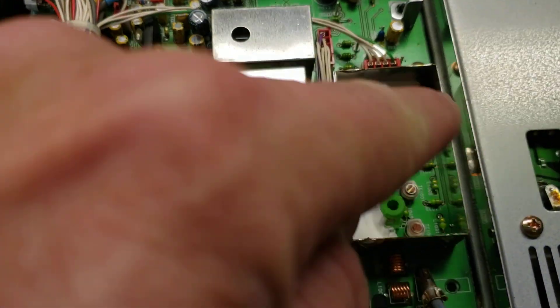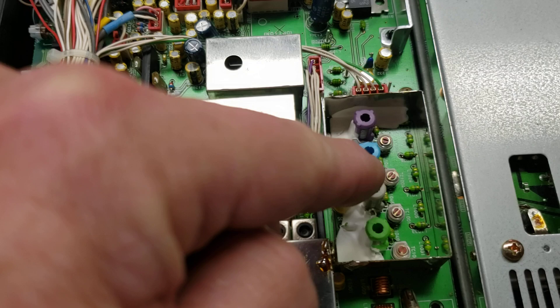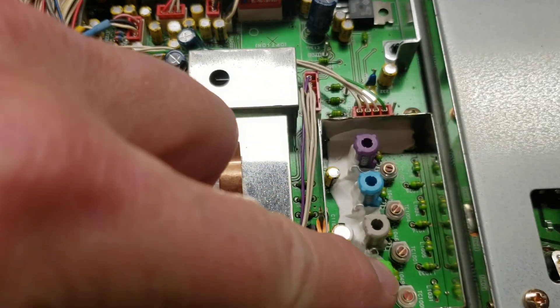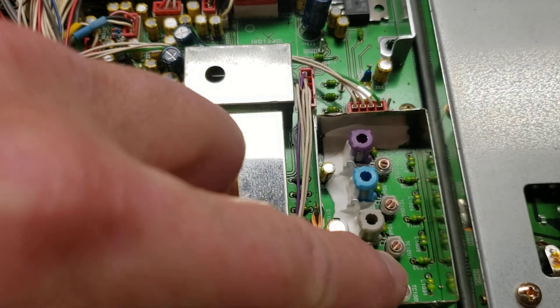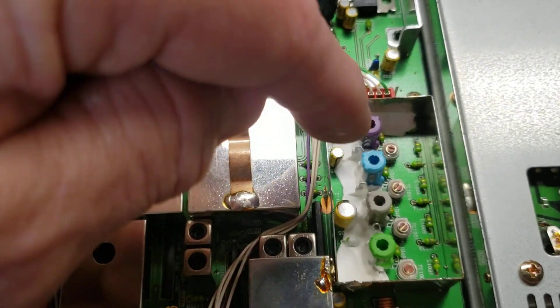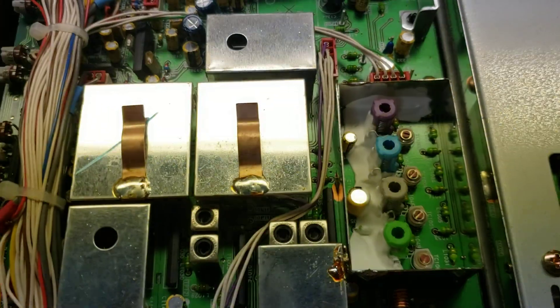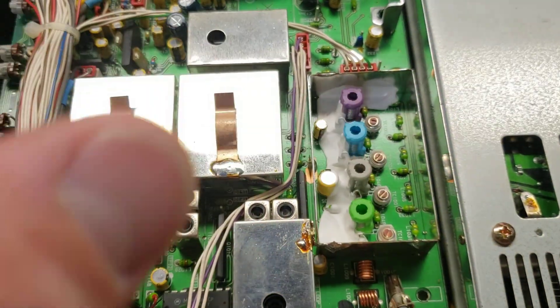It's usually where the VCO unlocks, and you've got four VCOs for different band segments. These coils here have steel pins that go through the board, and so over time those steel pins' solder connections will fail.